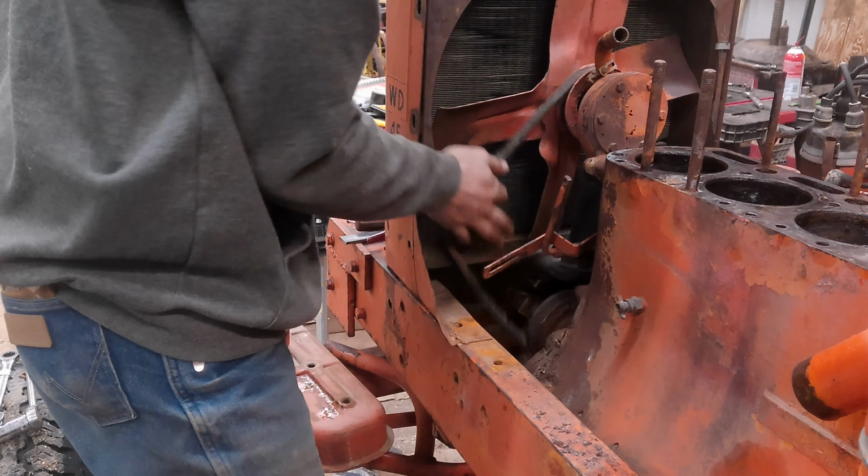Okay, I finally removed it. So there's, on the bottom of this radiator core support, there's welded nuts. So then it bolts up from the bottom. Well, this side had cracked who knows how long ago and the welds broke loose. So that capture nut was just spinning around. So I was able to finally wedge an open end wrench on it.